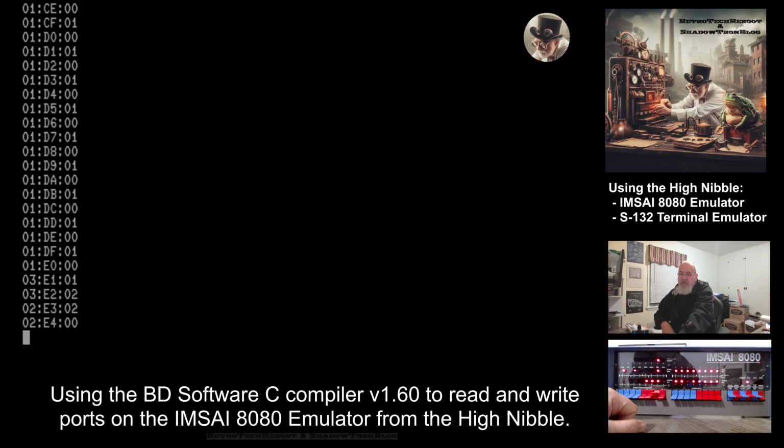If we look at the next bit being output, it's blinking at half the speed. That has a bit value of 2. So we've essentially taken the output, or that loop counter, and divided it by 2 and divided it by 4. It gets slower, and we can enable, like I said, any combination of bits.